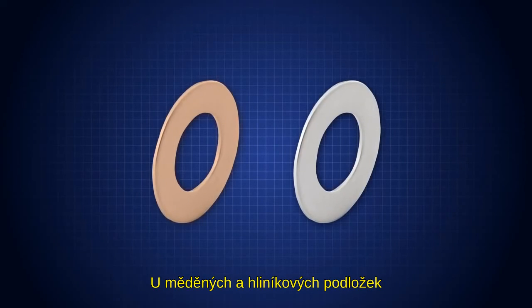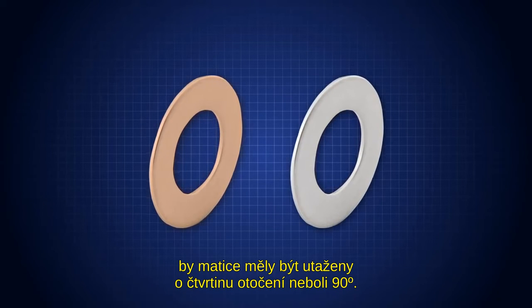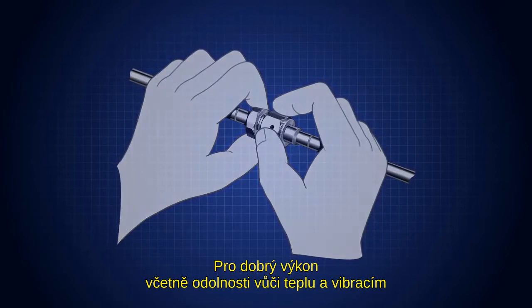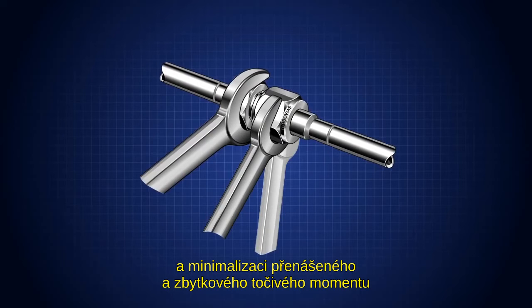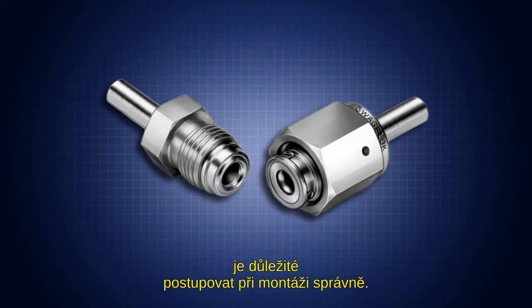Female nuts used with copper and aluminum gaskets should be rotated one quarter turn, or 90 degrees. It is important to follow proper assembly techniques to ensure good performance, including thermal and vibration resistance and minimal transmitted and residual torque.